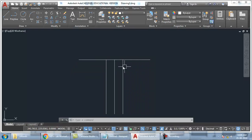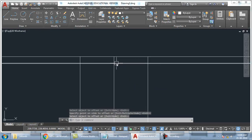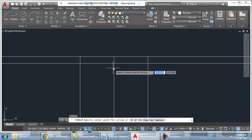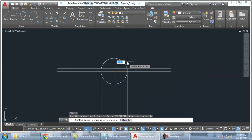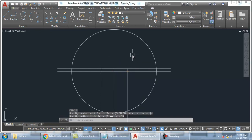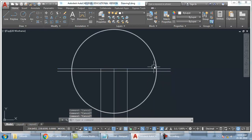1mm. So I will take 1mm offset below from the top. So this point is the center for me. So take a circle. Center. And what is the diameter? 1.6 into D — that gives us 16. So 16. Now this is the top face of the plate. This is just for center.